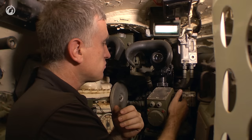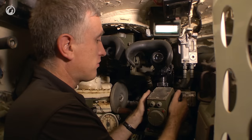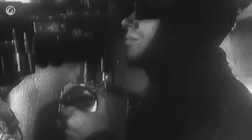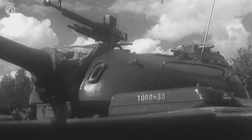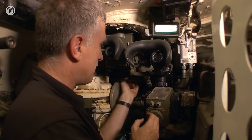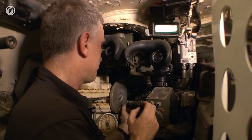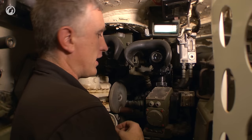A small problem for people who come over on exchange with the US Army: this is not the laser, this is the trigger. For those who don't know Abrams tanks, it's laser then trigger. We had a Romanian exchange student come over and he went — laze, boom. Whoops. The laser was the index finger, so it's what you call a 'laze boom' when you try to laze the target and then it goes boom. Other features: there are manual backups, of course. There is the manual traverse — very smooth, very well-balanced turret — and the manual elevation as well, which is extremely light and very quick.